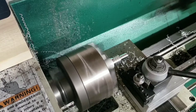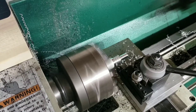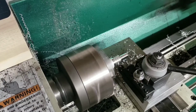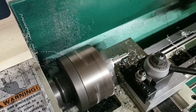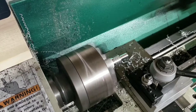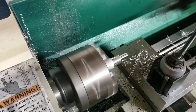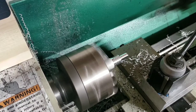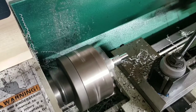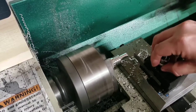Obviously, if this were a production part, I could work on my recipe here — speed it up, fix some of these unnecessary moves between different cuts, and I definitely can work on the feeds and speeds to get rid of some of these bird's nests. I actually think I'm just not taking enough of a depth of cut, not being aggressive enough to activate the chip breaker, so I've got to work on that still. But the parts have been turning out great.